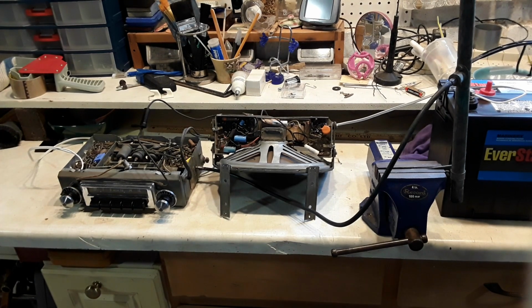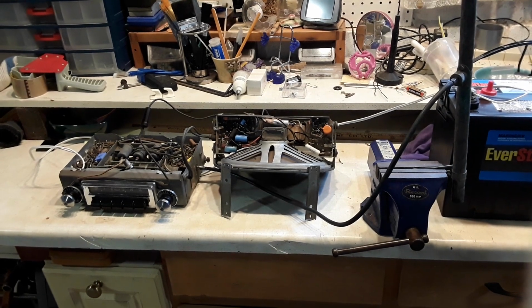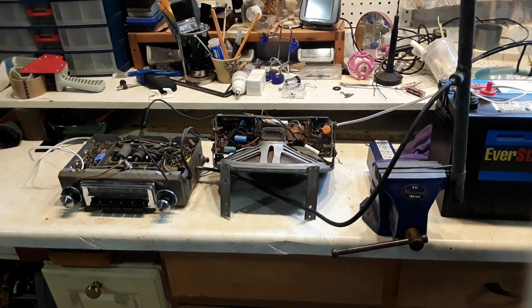So thanks a lot for watching this video series on the car radios. I'm not the most experienced guy with car radios, and I'm a little anxious each time I work on one, but the main thing about this radio was raising its volume. I succeeded in doing that quite nicely and found a little bit of a problem with the alignment of the IF and was able to correct that. Everything else seems okay, and that's it. Bye.